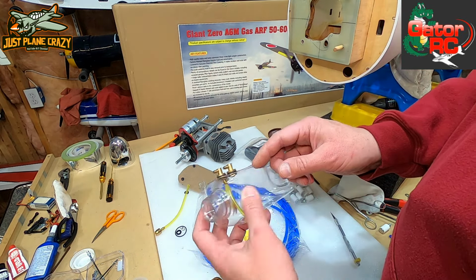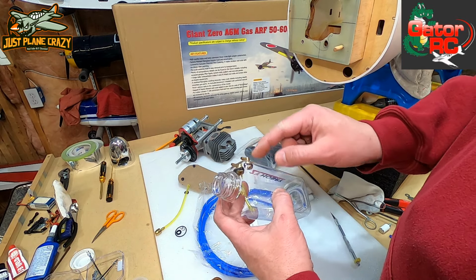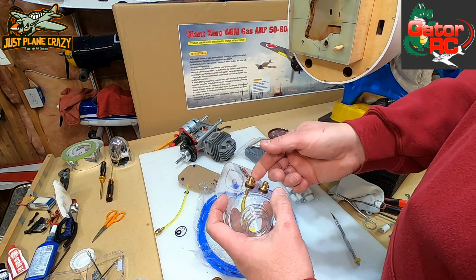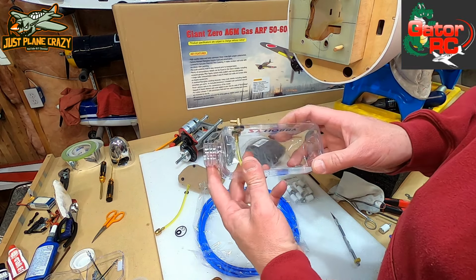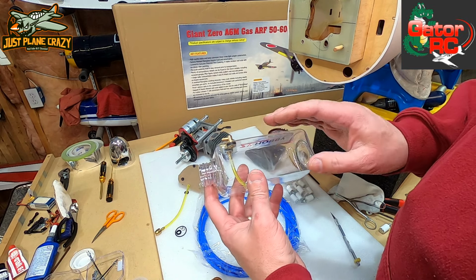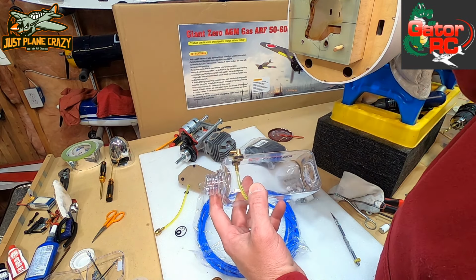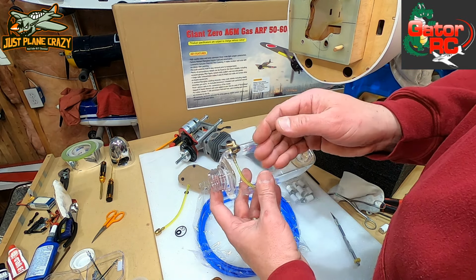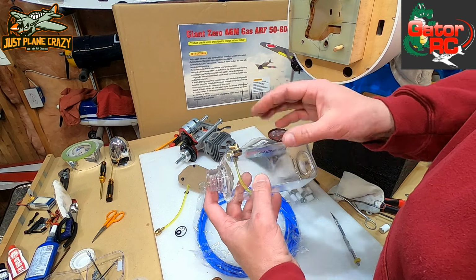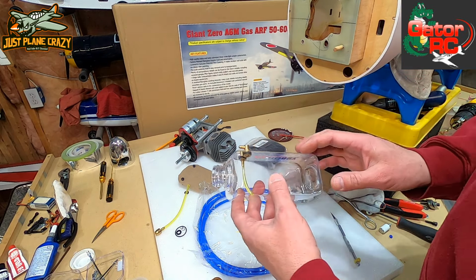These fittings, typically the vent is the one without any hose. All right, so as we fill, this thing is, believe it or not, full all the time. It's full right now, just full of air. When we go to fill it full of fuel, we have to push the air out, so thus you need a vent. When we start to take the fuel out of this thing, we need to let air in, otherwise we create a vacuum. So expansion and contraction principles in play there.